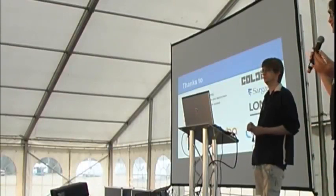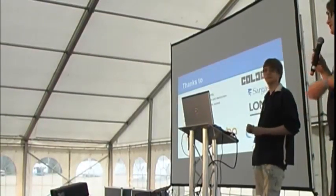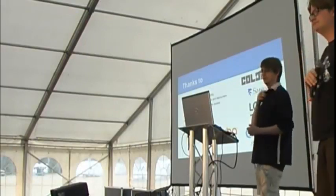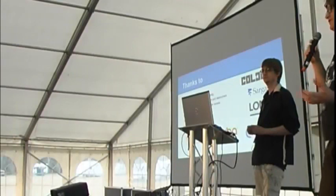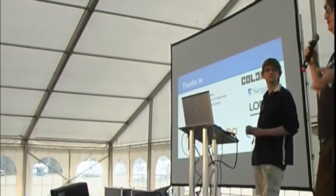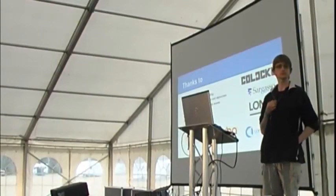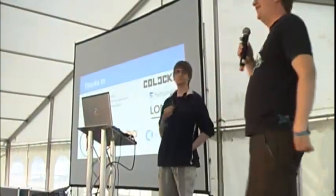In this case we're getting a lot of sponsored access points so we need to make do with what we have. All of these access points have omnidirectional antennas — it would definitely be better to use directional antennas, but we simply don't have them available. The number of 802.11AC clients was pretty low since we don't have that many AC access points deployed. We saw about 50 AC devices — mostly smartphones like the Galaxy S4, which is 11AC capable. But in the coming years we're going to see a lot more AC clients, which is good news as it means more 5 GHz usage — we can finally move away from the congested 2.4 GHz band.